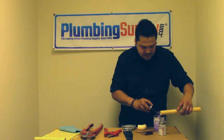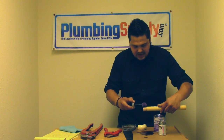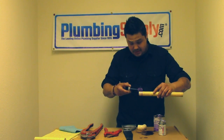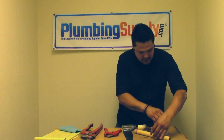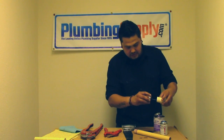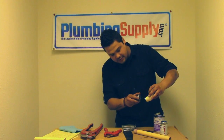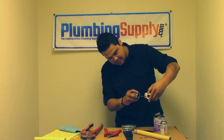I'm also going to prime up my fitting. You can apply it liberally — just make sure it's really good on there. You're also cleaning off any dirt or debris that might be on the pipe itself. Apply a very generous amount, holding it forward. This is another point where seals will fail: not having enough of this solvent and primer on there.